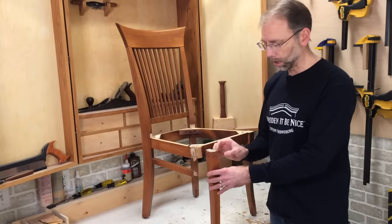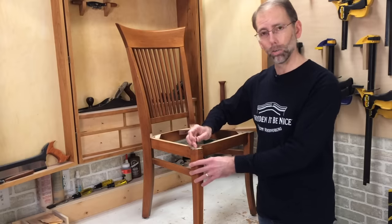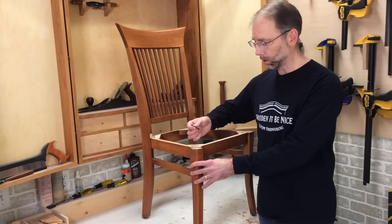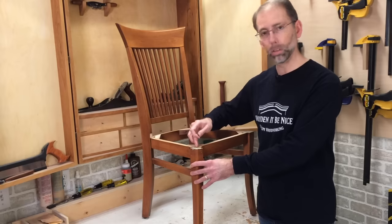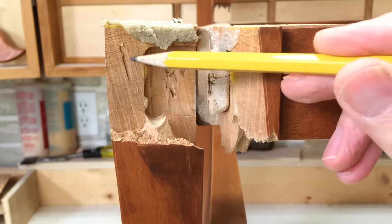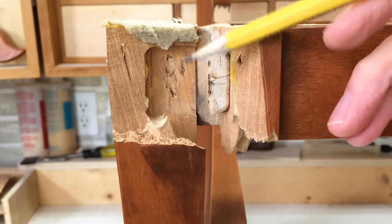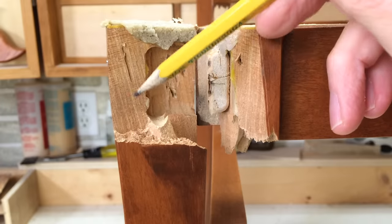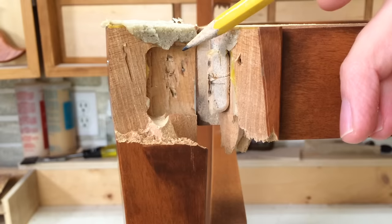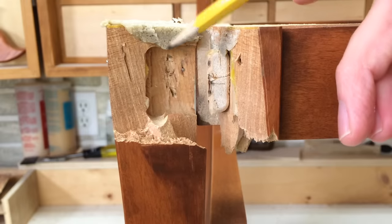I'm going to glue this all back together. I can't fix the grain pattern, but the addition of a longer screw right through the meat of that leg should help. Normally I don't recommend putting screws into legs because metal and wood compete with each other and the metal will wear out the wood, but the way this chair is constructed, it really is the only solution to help add strength to the glue. Look at this construction adhesive — no wonder this chair repair failed. I'm going to be putting wood glue on the clean surfaces and epoxy where I've got voids. I actually use five or six different glues in my wood shop — I've got a separate video on that linked in the description below.